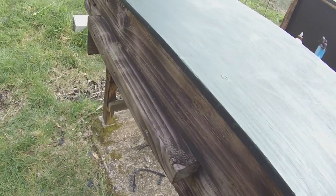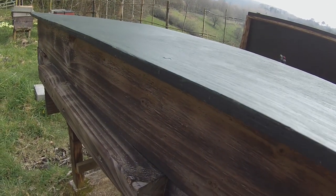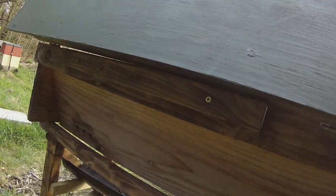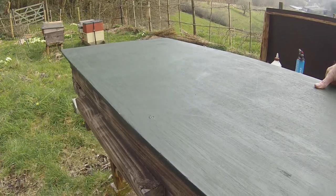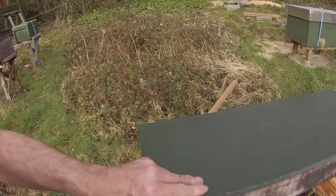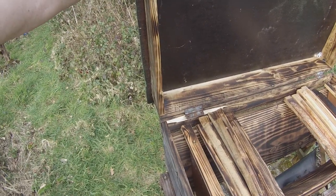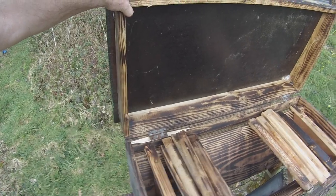This block here is what the back of the roof rests on when I open it. That's an okay arrangement, but not great — there's a certain amount of leverage against the edge of that block which could potentially rip the hinges out. I'd much prefer to have a chain stay on this lid, and that's what I'm going to fit here. I'm going to fit chain stays on this roof as an extra precaution against it blowing off.